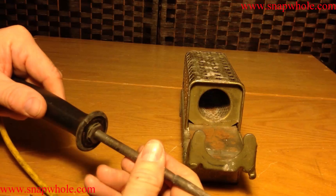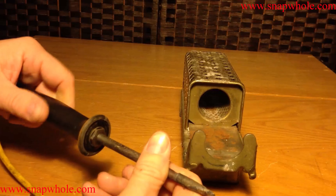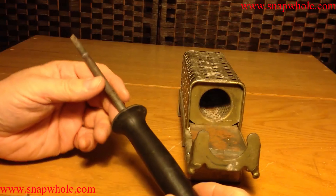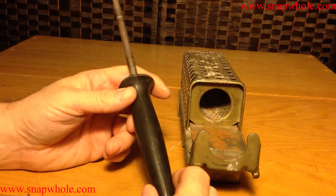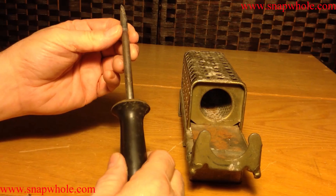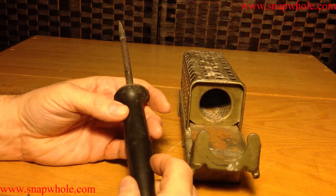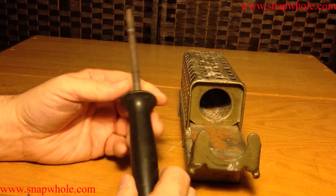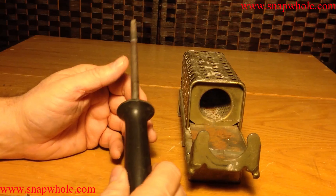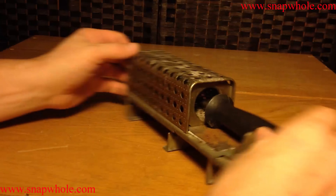When I got to looking at this soldering iron that came with it, it's a GE Company catalog 6A274, 60 watt, 120 volt. So it's a 60 watt soldering iron — really nice for working on antennas. If you're soldering connectors or soldering pieces of the antenna together, this works really well. The 60 watt you would never use for electronics; it would destroy whatever you're working on.